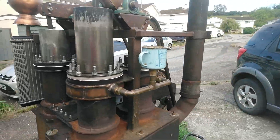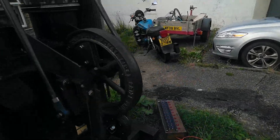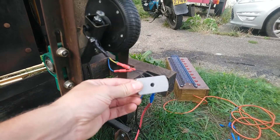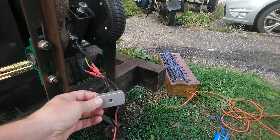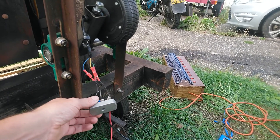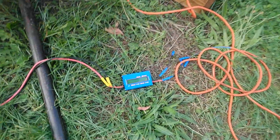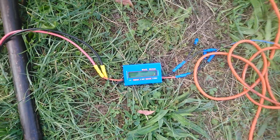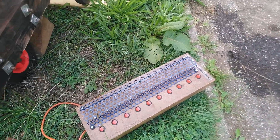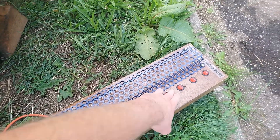To see what happens. For the load I've got this rectifier — there's no regulator, just a rectifier. The output voltage is roughly 20 volts at the usual engine speeds. That will be going through our wattmeter and then on to our load bank of lights. I can turn these on and off individually to apply a load to the engine.